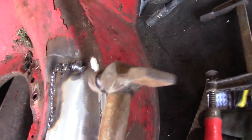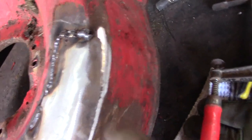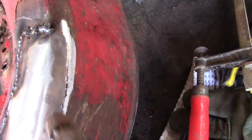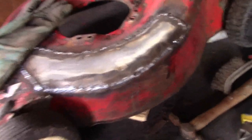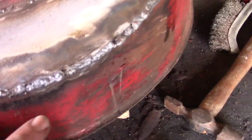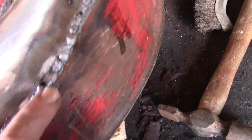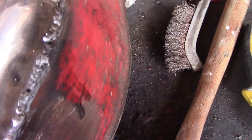Now we're taking a small hammer, just tapping it down, working our way around, and we'll clamp it down a little then put a few tacks along the edge right around, and that should leave the job near enough complete. The patch is welded and finished — it's not a perfect weld by any means, but it has really improved the lawnmower and it's going to get me to the end of the season. Rusty metal, no matter how well you clean it, is quite difficult to weld, but mostly it's good with just a few imperfections — I'm happy enough with the job.